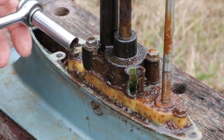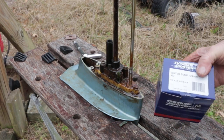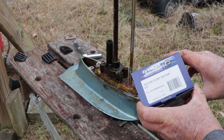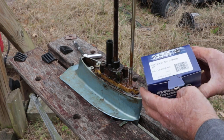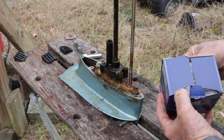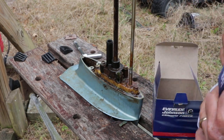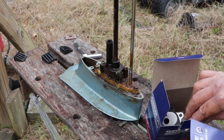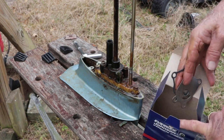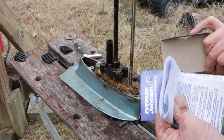As broken as that is, I should be able to just spray some stuff on it. This is the water pump repair kit - I got the Evinrude Johnson part number 0396644, I believe that's the one it called for. Let's see what all we got here. We didn't get that black piece in this kit, so here's what's in there: some gaskets, the plates, and the cup.